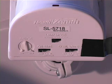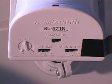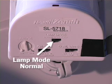Next, set the on time control to 1 minute. Do not use test mode for this test. Dual bright should be off and the lamp mode feature should be set to normal. Wait until dark and walk across the path of the sensor. The fixture should come on and remain on for 1 minute after all motion is stopped.